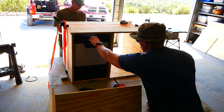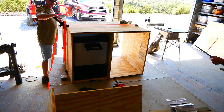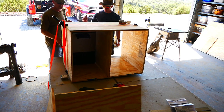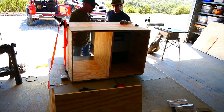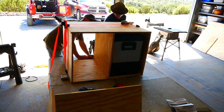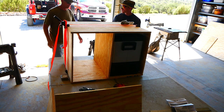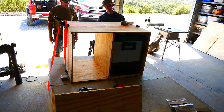You can see that middle piece between the fridge and the open side — that's where we used the dado blade to cut grooves into the top and bottom pieces so it sits nicely and becomes more secure. My dad had a really cool ratchet strap system that can hold boards in place so you can create a box. We were testing to make sure everything was measured correctly. The fridge was on the wrong side at first, which was a little funny, but we got it figured out. Then we put lots of wood screws in — we weren't going short on screws, making sure the outside form was secured and won't come apart.